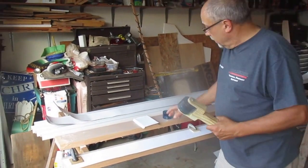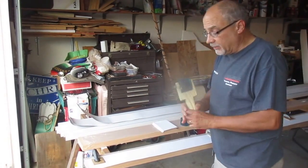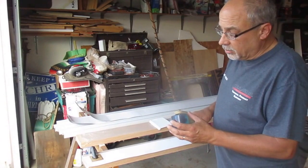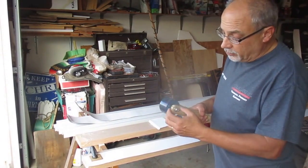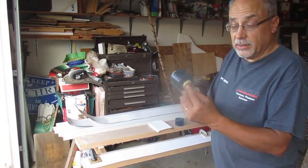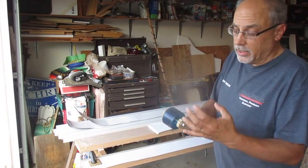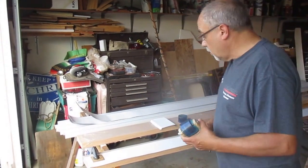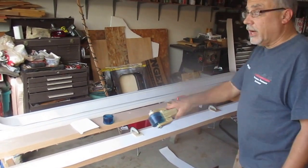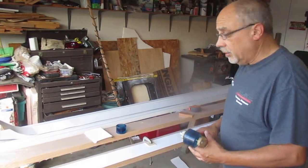What I came up with is making this handle and wheel — this is a skateboard wheel. It has a 5/16th diameter hole in it, so I took a 5/16th carriage bolt, ran it through, and used copper sleeves that I cut from some copper tubing along with some washers. That gave me a soft roller on a usable handle. My thinking was to run this back and forth, gradually changing the angle and pressure to get a 90 degree angle.